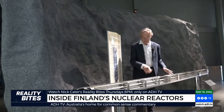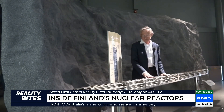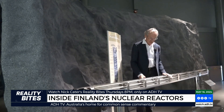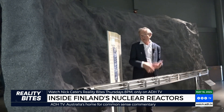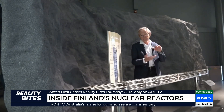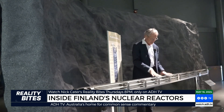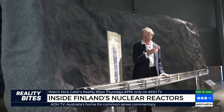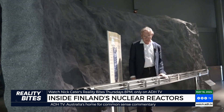When it comes to disposal, this is what you're disposing of — these are the fuel rods. These are just models but this is an exact replica of what a fuel rod would look like filled with uranium. This is lowered into water in the reactor, heats the water, superheats it to about 300 degrees centigrade, puts off steam under pressure, and that steam powers the turbine in the neighbouring turbine hall. These last about five years. Every five years they have to be taken out and new ones replaced. There are about 250 of these in that reactor, so about 50 are getting replaced every year.